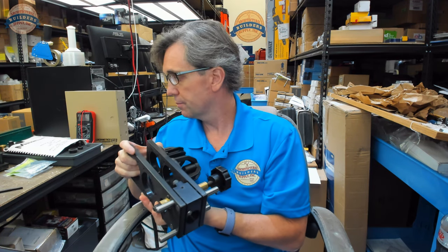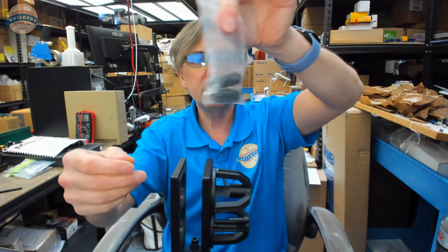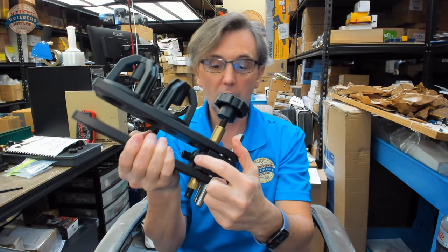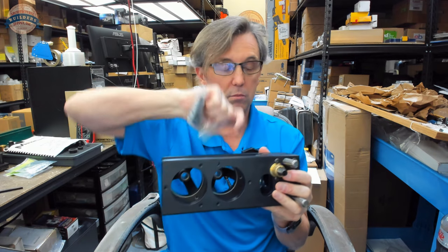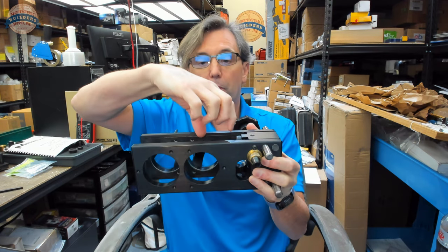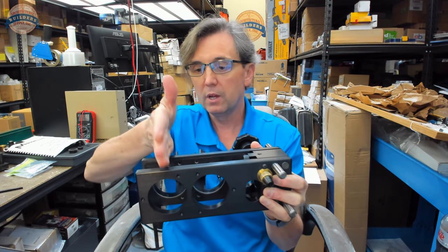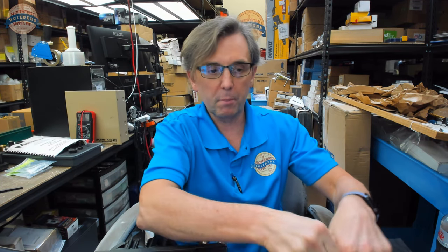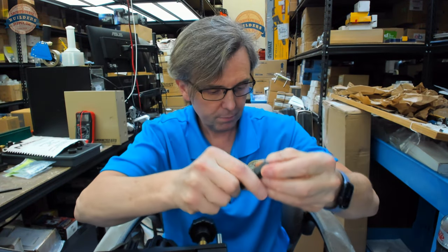Now, since we're talking about back sets, these would be the two pins that you would install to do 3 3/4. So your two bolts will come out, you will secure them here, you will put the 3 3/4 bolts in, tighten them in, and then at that point, 3 3/4 is going to be over here, is what it'll be. Because those bolts will force the HIT 55 to be hanging more off the door than usual. So your 3 3/4 will be here. Okay. So that's what these two bolts are for. Let's remove them from the package. Take a look. There they are. Okay.